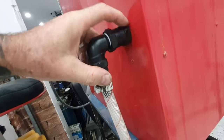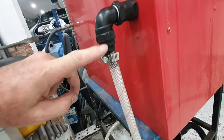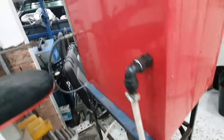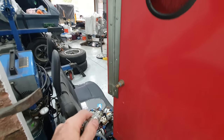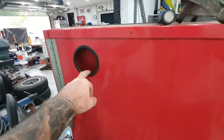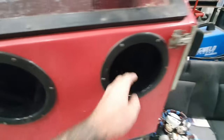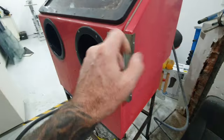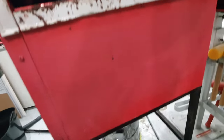All these plastic fittings are just gardening fittings for hooking up sprinklers and stuff. There's a three-quarter inch socket, male-female elbow, a reducer, and a barbed fitting on the back. This is the standard air outlet the cabinet has when you buy them. I don't use the inlet. You can tell it's starting to leak on the floor — as I'm blasting it runs down the side of the cabinet. The gloves are for your arms but the door doesn't seal perfectly.